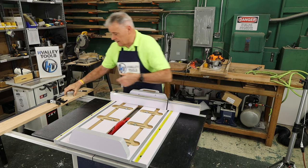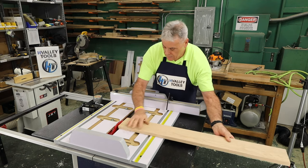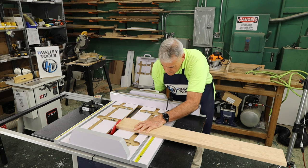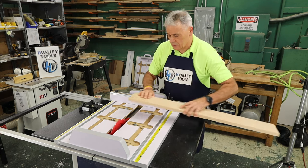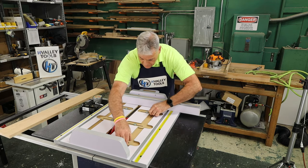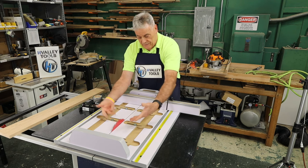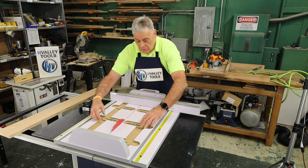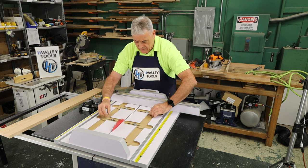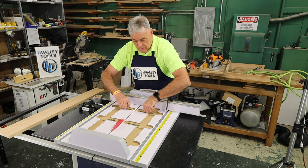We have to raise the blade to clear the gullets. My one gullet is not clear yet. Okay, that's about right. So now we have a good position for our blade and we want to adjust the inserts. We're just going to bring them over to the blade — that's tight to the blade, that's going to nick it. All we do then is just back it up a hair, literally, so that there's about a sixteenth of an inch. It doesn't have to be perfect. Then you just snug them down. Now you've got a zero clearance insert for your blade.